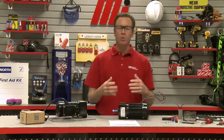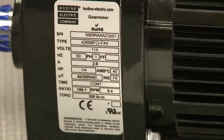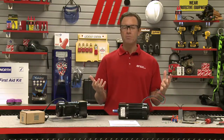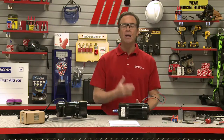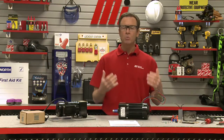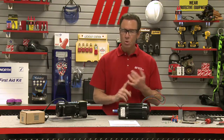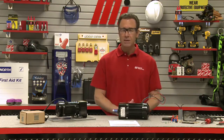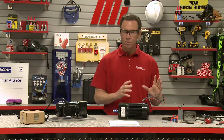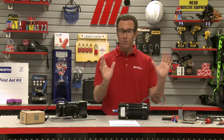Next, we need to identify the correct capacitor value for the gear motor, and that can be found on the motor nameplate. There are several different kinds of capacitors, so you want to make sure that you choose the right one for your application. The capacitor ratings are in microfarads and volts. Using a run capacitor with the wrong microfarad rating can result in either low starting torque or higher motor temperature, which can damage the gear motor. If you use a capacitor with a lower than required voltage rating, that can result in overheating and damage of the capacitor.